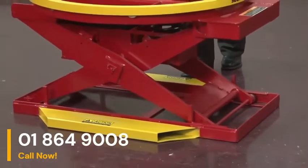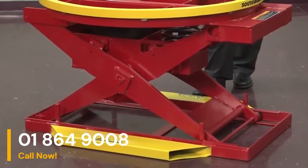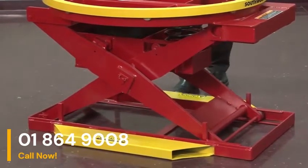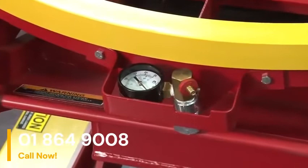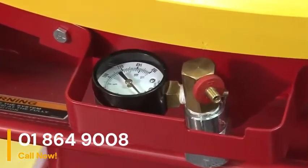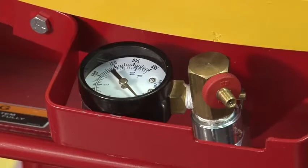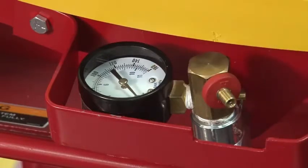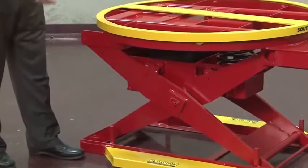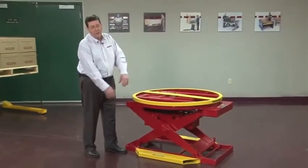The AirPallet PAL has a spring in it, but the spring is just an equalizer or counterbalance to make the structure weightless. The airbag inside the metal box under the legs is actually doing the positioning. There's only one adjustment: filling the bladder with the proper amount of air. A calibration table in the owner's manual guides you, and an air hose with a common air chuck is used to fill the bladder. A gauge reads how much air is in the bladder. The bladder is preset based on the height and weight of the pallet, so the air compresses as the load is put on and the bag opens up as the load is taken off.